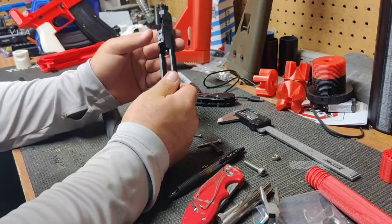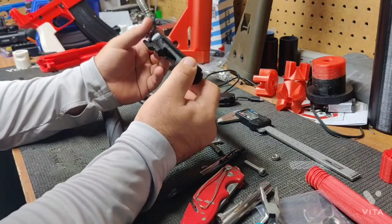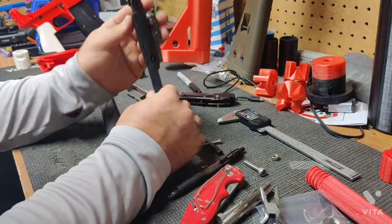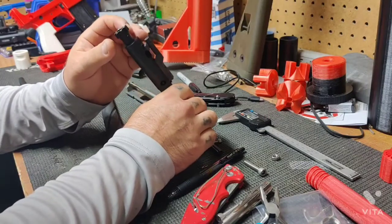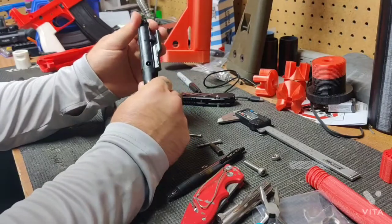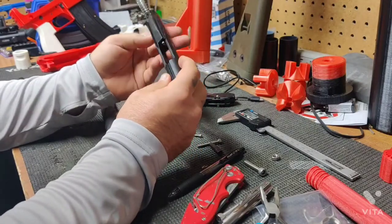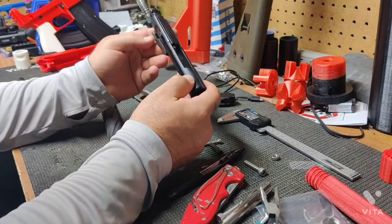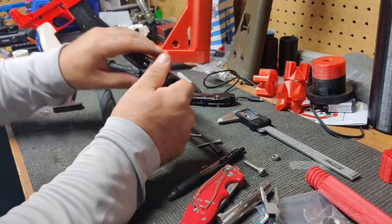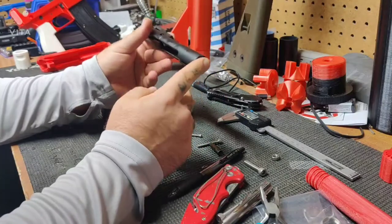This is not something you're just going to go out, buy a block of metal, hand-file it, and make it functional. You're going to need a little bit of tooling and somewhat precision machining capabilities. I think you could do it with a benchtop mill, but that's dependent on the quality of tooling you can afford, your level of experience, and the cost. You would need to be buying annealed tool steel of some kind.